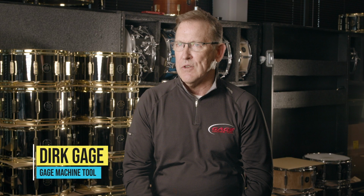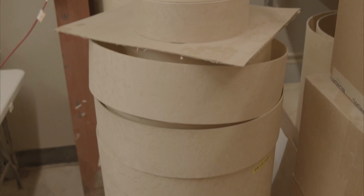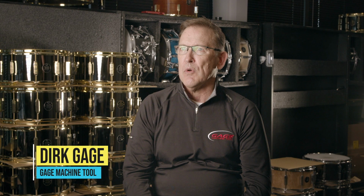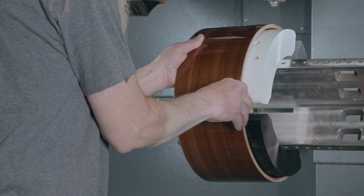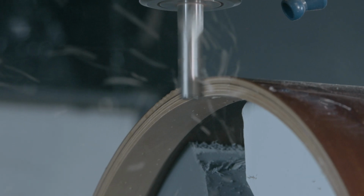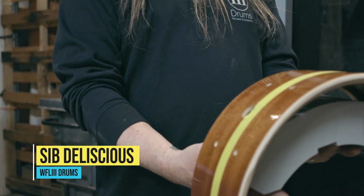I started indicating drums and to see how round they are. And we found out that they're not round to begin with, they're flexible, and as you tighten it up in between the jaws, it would shrink in. So put 3 of these together, you have 300-degree clamping surface at a 360. Not only are you gonna have a rounder drum, but your pressure is equal and you won't crack the drum or ruin the drum. These shoes are designed for each size of the drum.